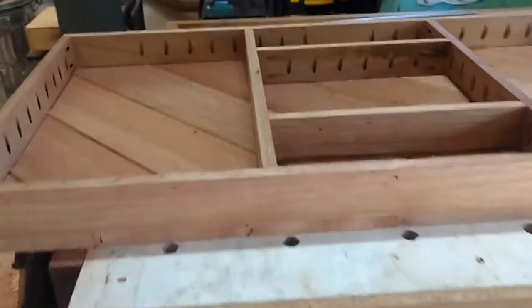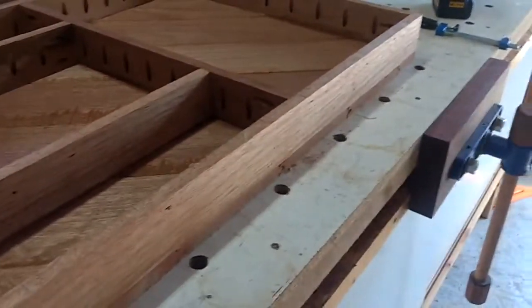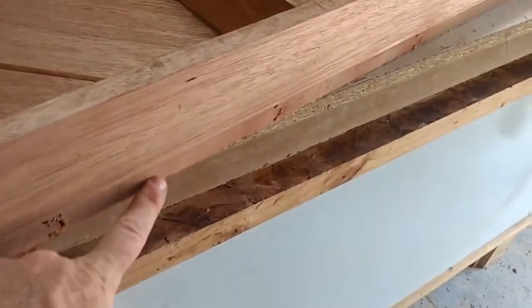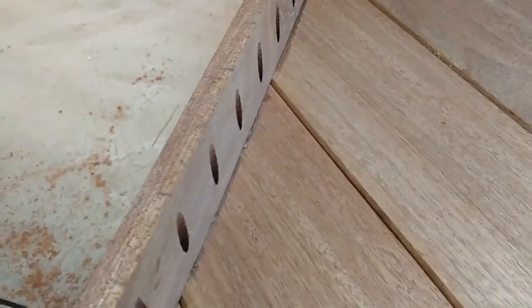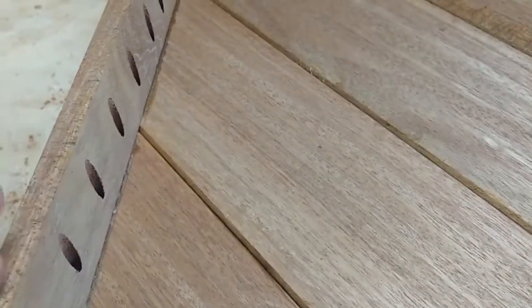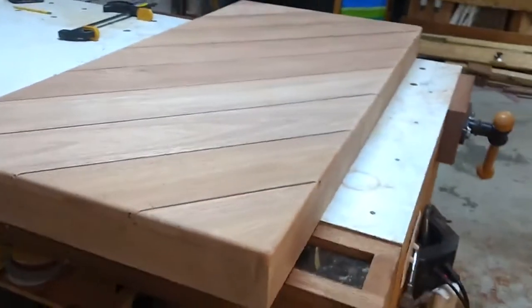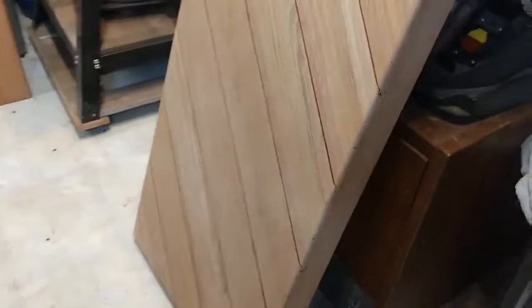I finished decking out the top of the first board and just took a flush trim bit with a router and flushed up the edges. But before I do the round-over, I went ahead and took all the pocket screws out of the perimeter — they've already done their job, the glue is dry. Those pocket hole screws come real close to the surface, and I want to put a 3/8 inch round-over and I don't want to be picking off the tips of those screws.